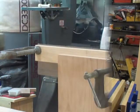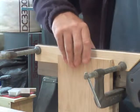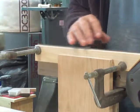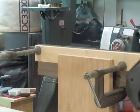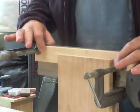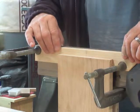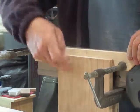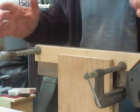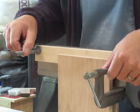Okay, I'll show you a couple things. This is my saw holder or saw vise. It's chucked in the bench vise. I don't like any movement, so sometimes I'll put a C-clamp at the ends. You can put two pieces of wood, C-clamps, on the saw. If you have a vise that it will fit in, you can put that whole setup in there and skip the C-clamps.